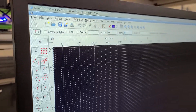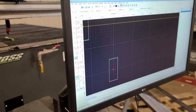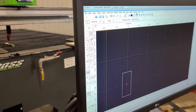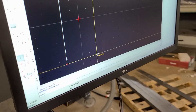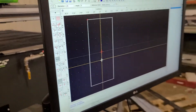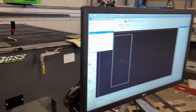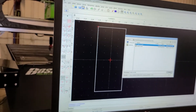Set the height to 90. You can drop the rectangle anywhere you like. Then create four smaller circles — quarter inch or one inch, whatever you want — and drop them right on the four intersections of the rectangle corners. Then hit File > Save As and name it 'table square' or whatever you like.